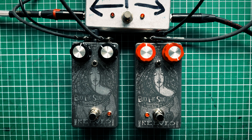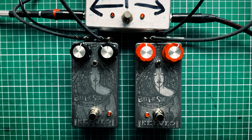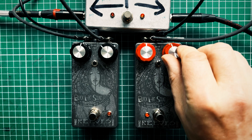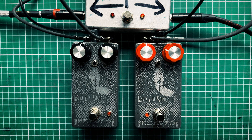So that's it set pretty much with the bias fully open. Let's have a listen as we close down the bias. You can hear the voltage changing, and then you can hear the transistors actually cut off — that's what we like to call the point at which it gates. So there's no signal traveling through the transistor, and then you touch the strings and the transistor bursts into life.